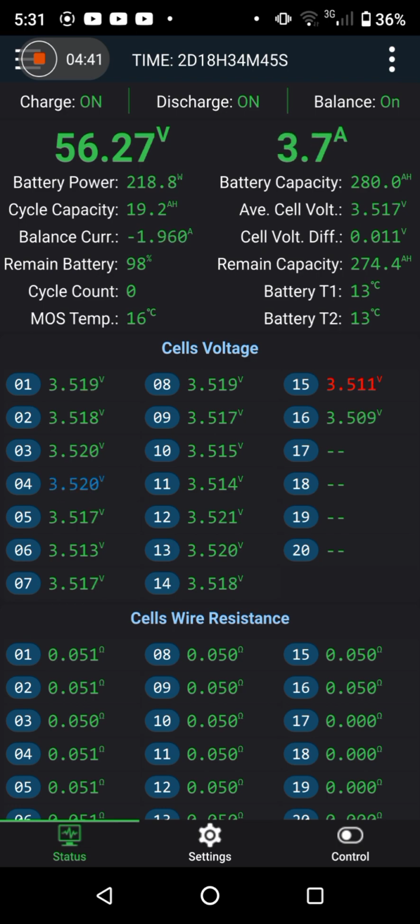That's the balancing just kicked in at 11 millivolts at 3.52 volts. So, yes, you can do a top balance just using the JK BMSes. I think this has been quite successful. Certainly been easiest and laziest. So, that 5 minutes of waffling in a screen recording, that goes quickly.